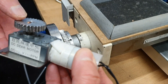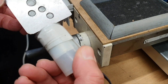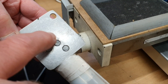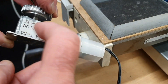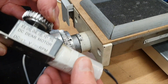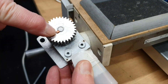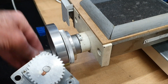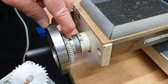To fit this to the milling machine I made up a stainless steel plate, which I had to drill some holes in the back to clear some of the little mouldings on the back part of the motor itself. The gear on this one is held on with a little keyway, and the gear on the handle here is held on with a little tiny set screw that holds it in position.